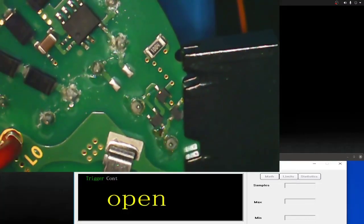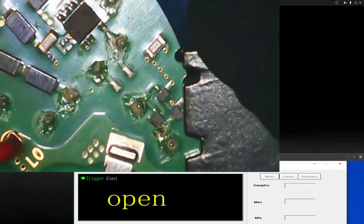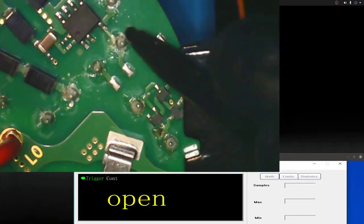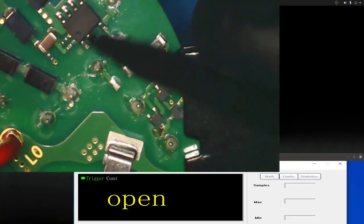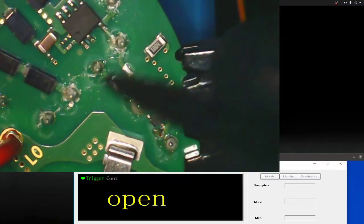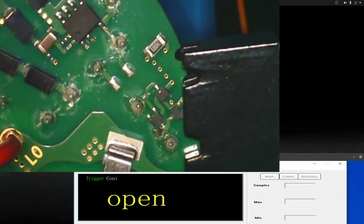Right, so looking at here, this is the back of the Death Ray. Capacitors. Those are 450 volt bad boys. Cool. Let me get that so it's not shiny. Right. So these are the pins for them. Straight off the bat, we can notice here, this goes off into a bridge rectifier. Basically, this is a switching power supply. So these will go in. I mean, this is the same thing as the YMAC unit, really, apart from this has got two capacitors as well. These caps will be in parallel, probably.